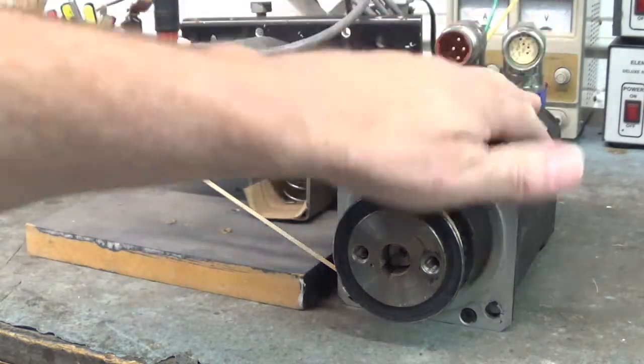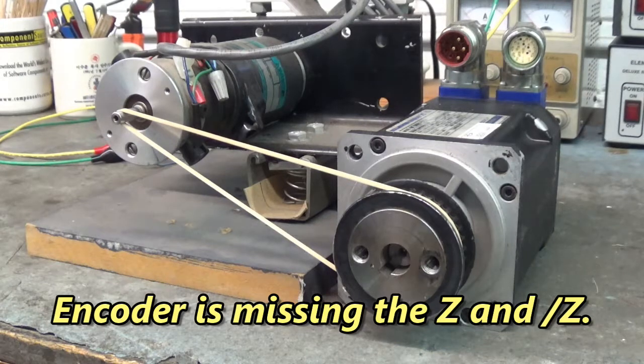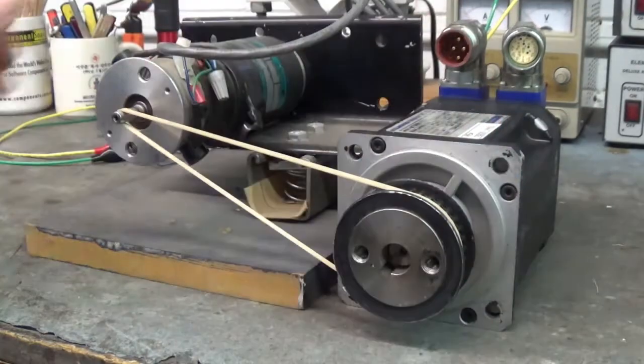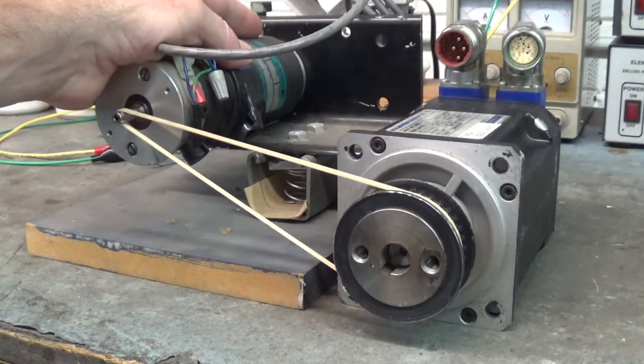This feedback here inside that motor is missing the Z pulse, so I've got to replace it. But before I replace it, I've got to document the Hall effect in relation to the windings of this motor. I'll show you how to do that in just a little bit, but here I have a 24 volt DC motor